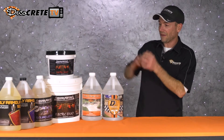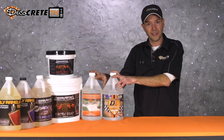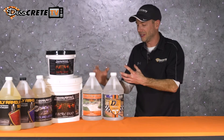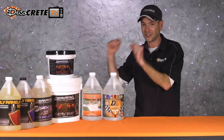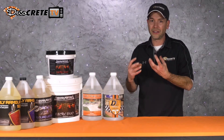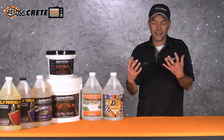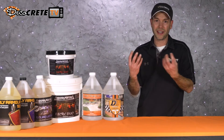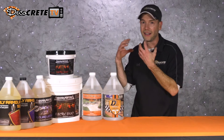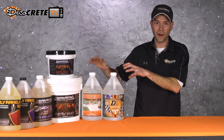To get things started, we're gonna have to separate things into two groups: acrylic sealers and concrete coatings. Starting with acrylic sealers — they actually start out as a solid substance. Acrylic is something that started its life as a solid, gets melted down into a sealer, and then spread out. Think of it like dissolving sugar into water. Once that carrying agent evaporates off, that actual resin is gonna harden up on its own — it doesn't need any chemical reaction, no part B or hardener. It's going to form that film all by itself.